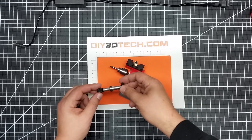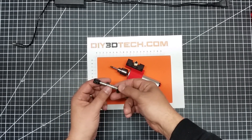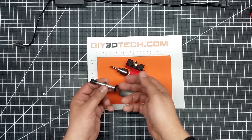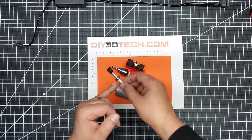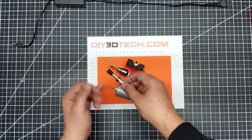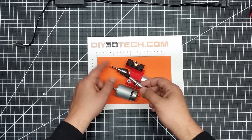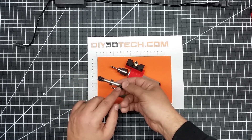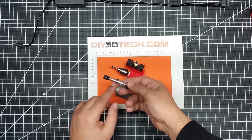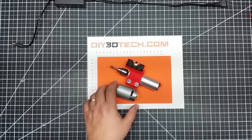The diameter is also a little bit bigger, because I've actually got this stanchion that I'm going to mill down — it's from an older hand grinder. It's got a little bearing and was connected to a small DC motor. This shaft is a little bit too big and I don't need this extension, so I'm going to take it on the lathe, shave this off, reset the mounting hole, and use this to set the center hole. It's got a little grub screw, so I'm going to move that up, chop it off, and put it on the 555 motor.